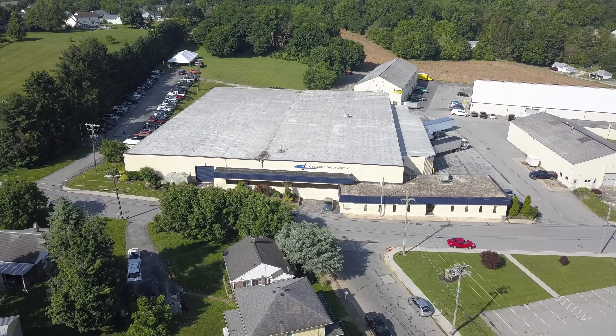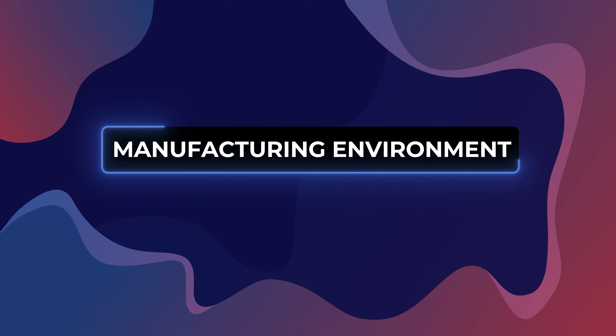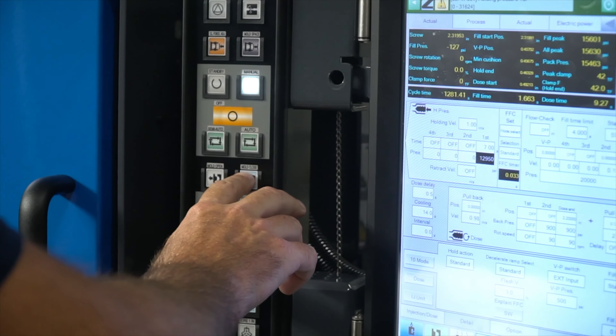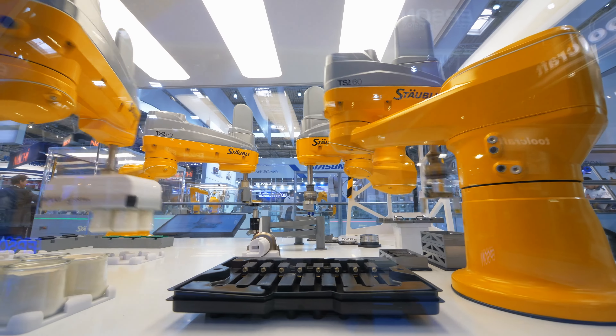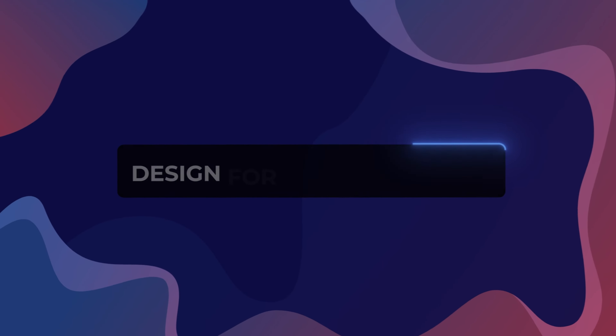The fourth variable, which is another specialty here at Crescent Industries, is the manufacturing environment. Seeing that medical molding is a large portion of our business, we are familiar with the regulatory requirements for certain components, which we meet using our positive pressure general molding and ISO 7 and ISO 8 cleanroom molding facilities. This will depend on the specific part requirements of your finished good, but if your component needs to be made or used in a specific type of environment, then these are all factors that need to be considered during the DFM process.